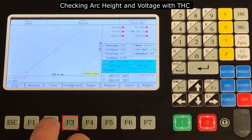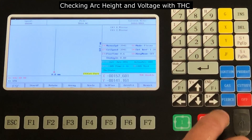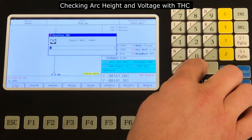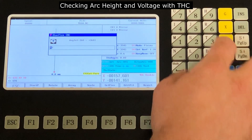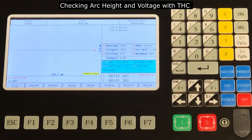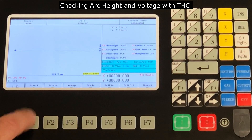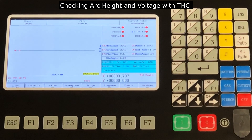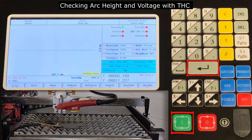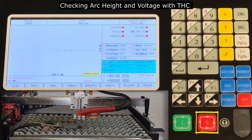Because the shape is on a 45-degree angle, I am going to select part options, then rotate and enter negative 45 degrees so that the part will travel across my X axis. In the part options menu, we can also change the start point of the program by pressing F1. Once all your changes are complete, press the escape key to return to the home screen. To start the cut file, press the green start button followed by the enter key. Once the program has cut for a few inches, I will press the red stop button while the torch is still above metal, then use my feeler gauge to double-check the arc height.